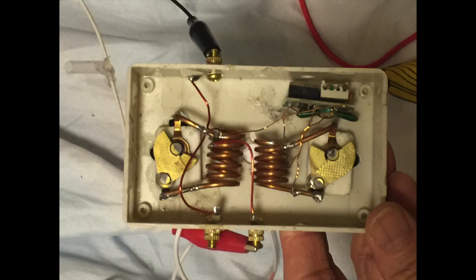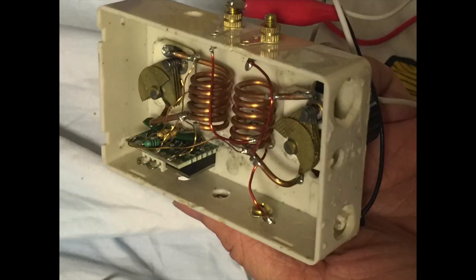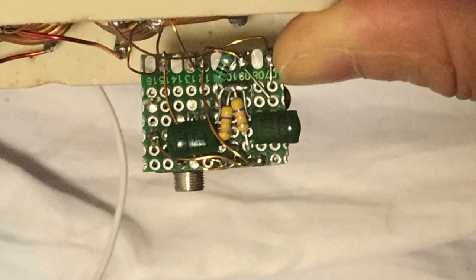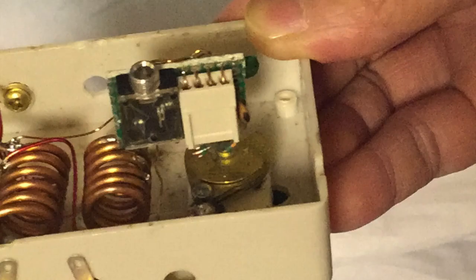I've used the case of my original FM frequency detector using the 3DQ. I just took out the 3DQ circuit board and inserted a new circuit board that I made for the diode Foster-Seeley detector. This is how it looks. I find that I need to get the two coils much closer together than the 3DQ version. So it is now half the diameter of the coil — as close as that — about half the size of an AA battery. Otherwise the induction doesn't work well; no signal is induced over to the second coil.